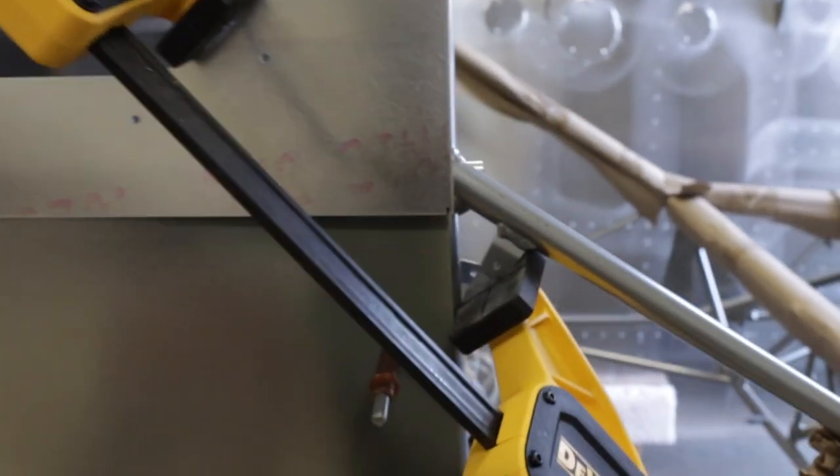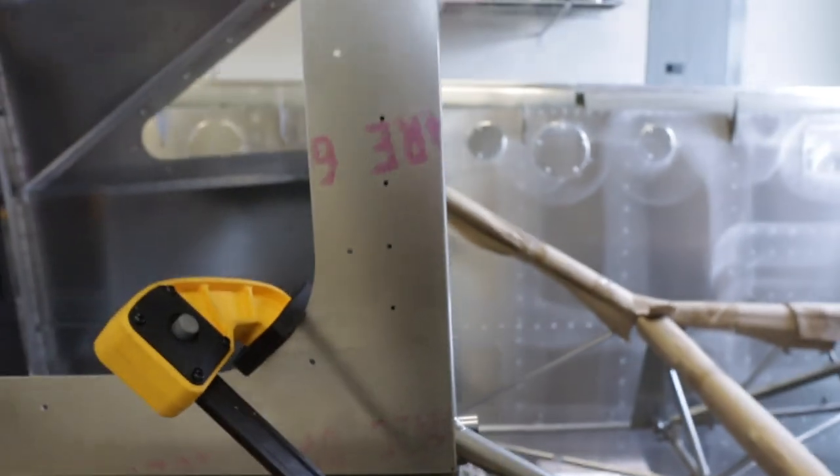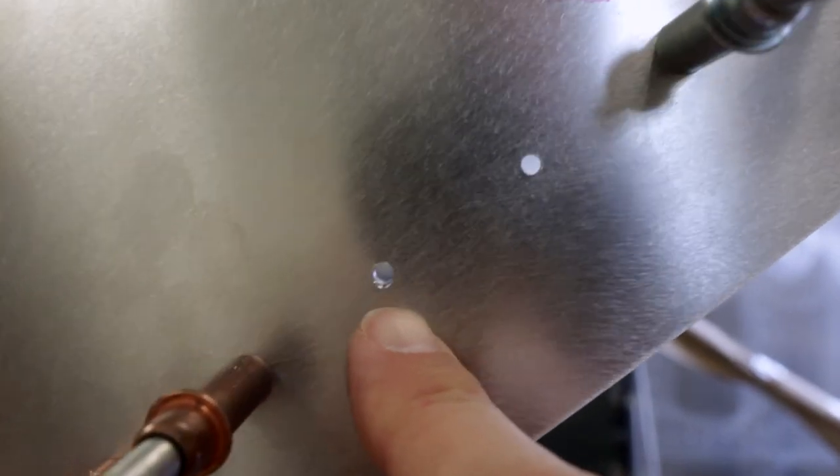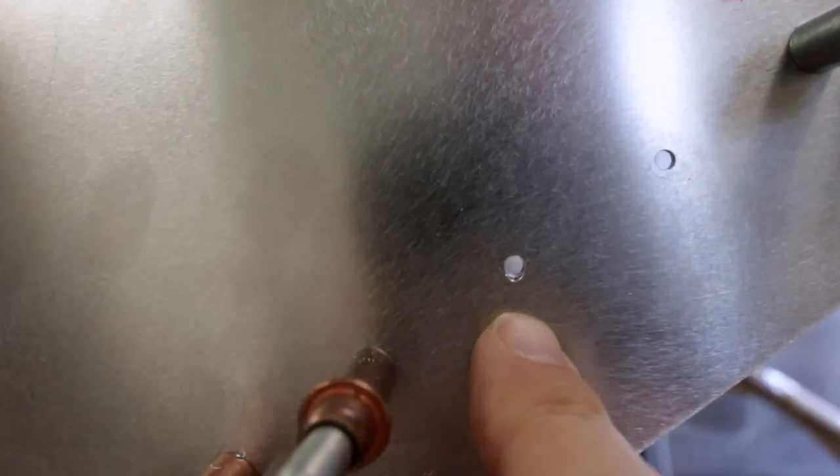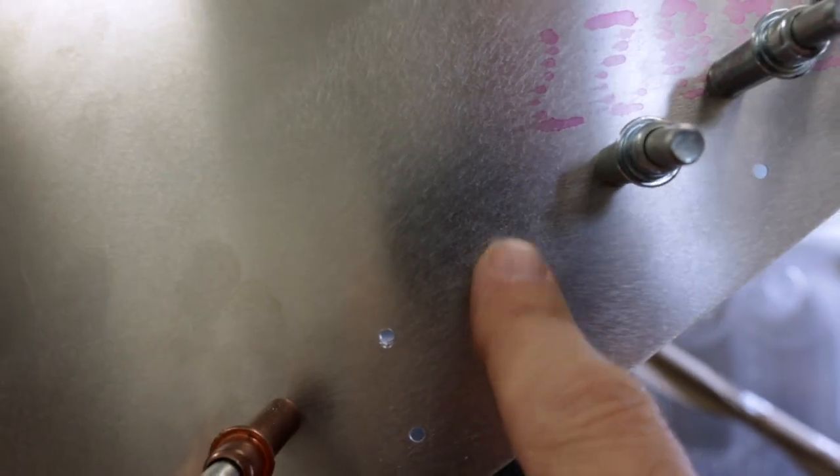This is left intentionally a little long so we've got to shear that off. Old hole drilled with size 30, new hole drilled with size 40, then final sized — old hole a bit oblong, new hole nice and clean.